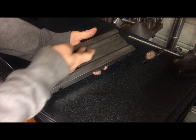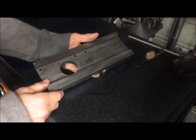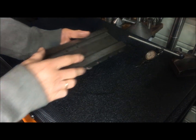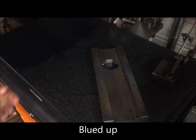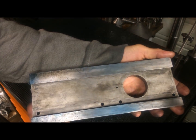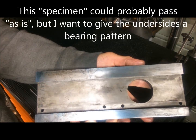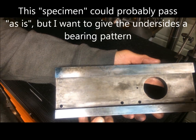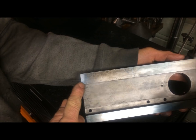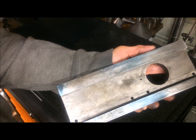On this side the gib strips or gib blocks come, so this is just a pristine area here. And this one was quite flat — only a very minor degree of surface flatness deviation. I am bearing a little bit here, but taking these straight down I think will be the trick.